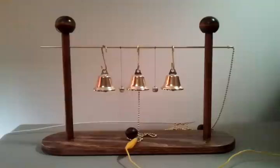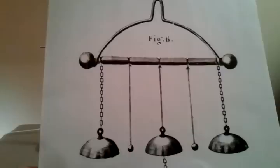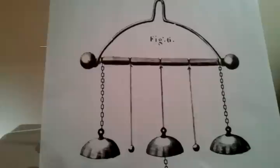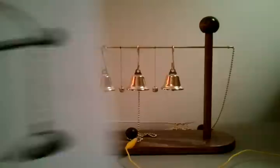It's said that there are no known photographs of Franklin's Bells — the originals. However, I did find this image on Wikipedia, and the article was very good in describing how this was made. That center bell and the two clappers were hung from a conductive frame by non-conductive thread. The two outside bells were hung by chain. The frame and the two outside bells would be grounded, and the source would come in through that center bell. And so that's what I used to make mine.